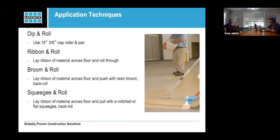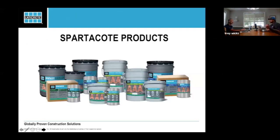But I'll actually make like a 6 inch or an 8 inch one. And I like to use it behind toilets and stuff in the bathrooms, because it is really, really hard to pour a blob and then roll it behind and around things, where you can actually pour a blob on one side, reach behind the toilet or stanchions on the floor, pull that through and then quickly back roll it. So when I'm on projects, we'll have 3 foot ones if it's a 5,000 square foot job. But if we're just doing restrooms and stuff, it's way faster than trying to do trim roll stuff. You can get really caught up trying to get behind toilets and cabinets and all those things. I've been on many trainings where I'm two rooms over and the guy's still trying to roll behind the toilet.